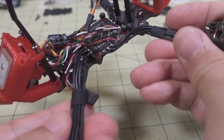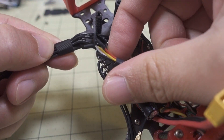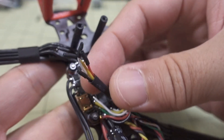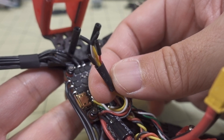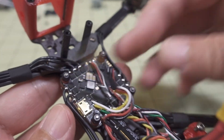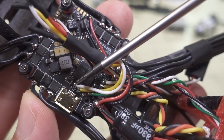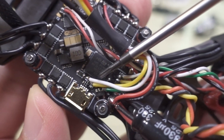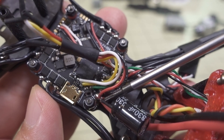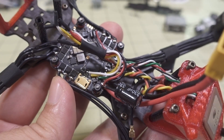For the connections you want to be aware of here, they've taken the wires and bundled them up. You have a bundle of four wires: red, black, white, and yellow. The white and yellow go to the board - white is T1 and yellow is R1, that's for UART1. The red and black go to the battery lead where the capacitor is - that's for battery power going to the Vista.